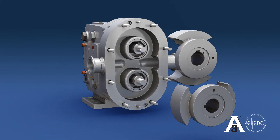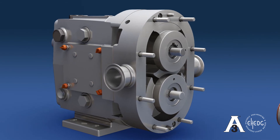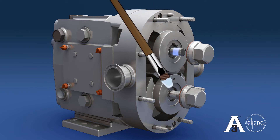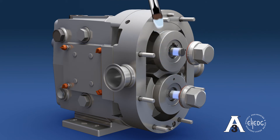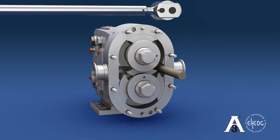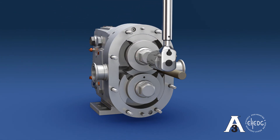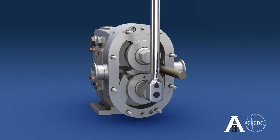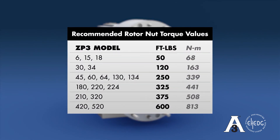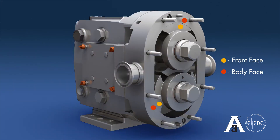The first rotor going back in the pump should be aligned in the 12 and 6 o'clock position, so there is no interference with the mating rotor. Before installing the rotor nuts, use food grade never-seize on the shaft threads to eliminate the possibility of galling of the nut to the shaft. When torquing the rotors down, use a plastic dowel to lock the rotors in place. It is very important to torque the nuts to factory recommended values. See the chart showing these values by model, referenced in foot-pounds. Run your finger across the front face to make sure the rotors are seated below the body face. If not, the seals are not aligned properly.